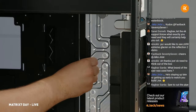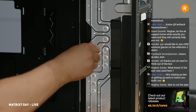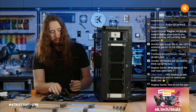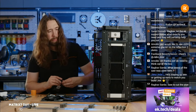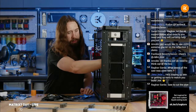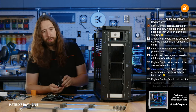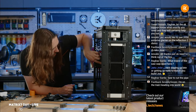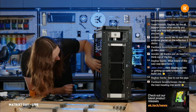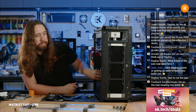And for all the others, they're going to get the micros, and they need the micros because these ports for the GPU are so tightly packed, because they're all close together. They're all spaced for PCIe spacing. They're 20.32 millimeters apart. Then you need to use the small diameter Torque micros so you have enough space for full size fittings. So I think this case has 1, 2, 3, 4, 5, 6, 7, 8, 9. Yeah, 9 slots.